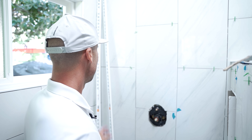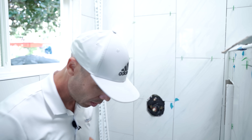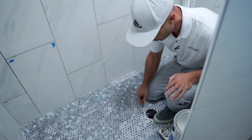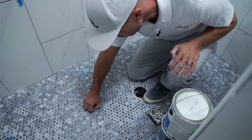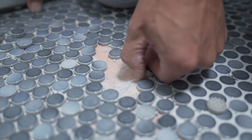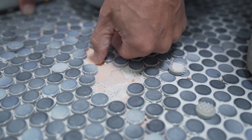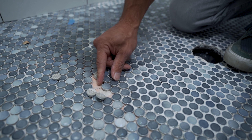It was probably a combination of a bad prep job and a bad tile installer, and it compounded itself to create one of the worst showers I've seen. We're going to take a few tiles apart. Right here there are penny tiles with no coverage — literally no thinset under those penny tiles. I'm pulling these out with my fingers because they're not adhered.